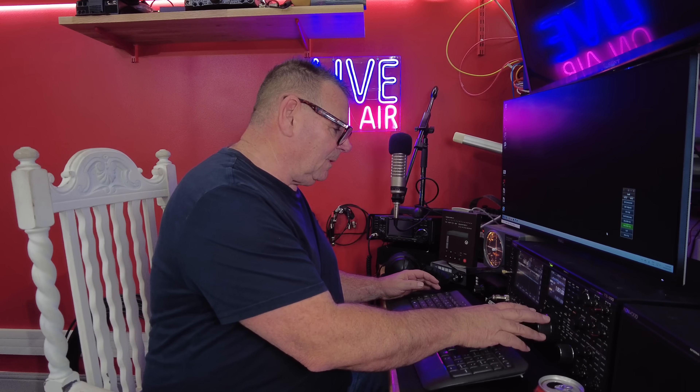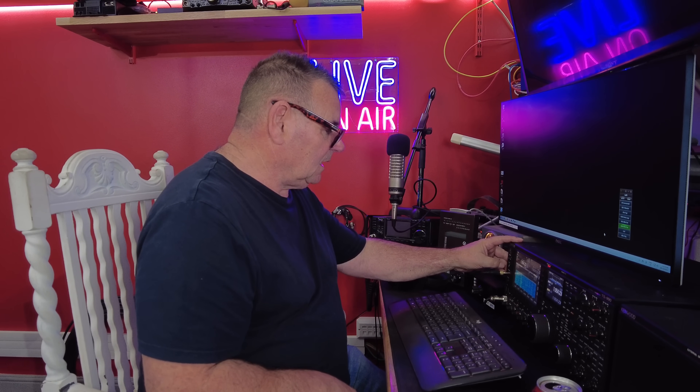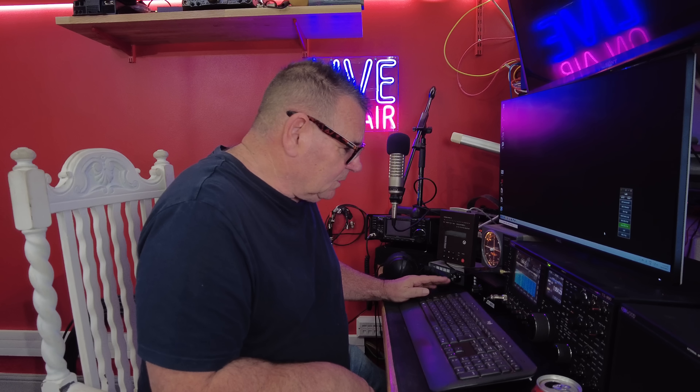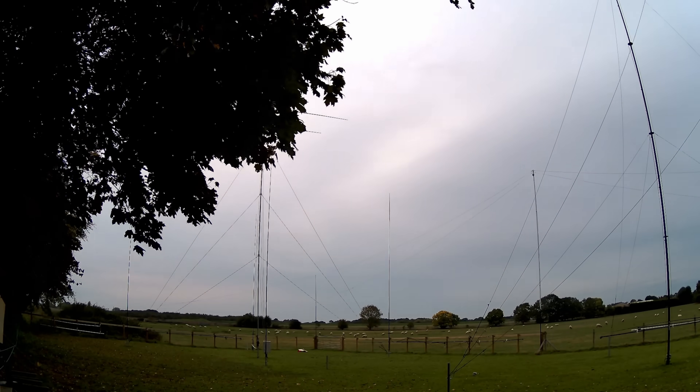There'll probably be nobody there — it's daytime. I can get a tune at 19.54. I thought it was about to struggle but it didn't. Overall the result is good, but we definitely need those parallel quarter-wave 75-ohm lines — just another day I don't quite have spare time for right now. We've got tomorrow — I'll do the rest of the four square tuning. We ran out of time today so I thought let's at least look at something I can do anyway. Enjoy your radio guys, see you on the next one!